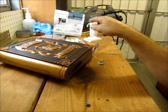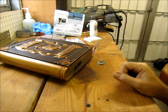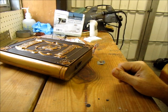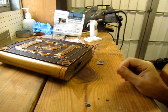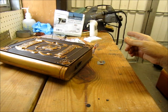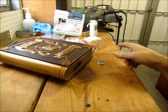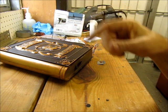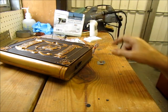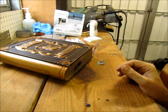You can get these in a different channel — this one is channel 2. Look for the little sticker on the box when you buy them. They can also be changed later; there's a jumper in there. You can get the controllers on the same channel so one transmitter triggers multiple props, or on different channels so one trigger doesn't set off multiple props.